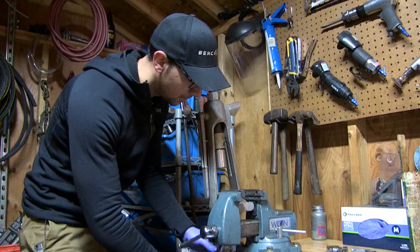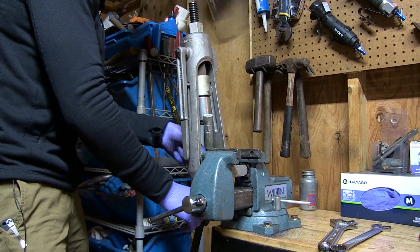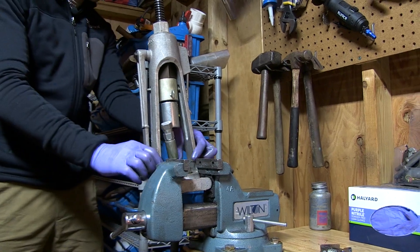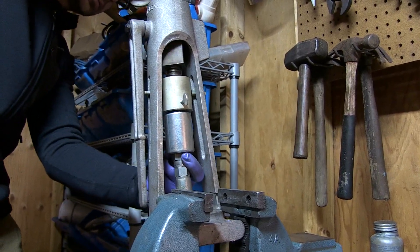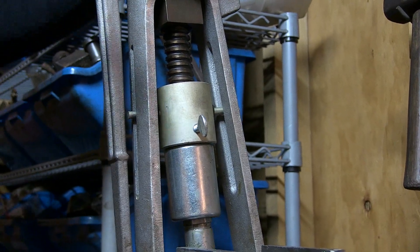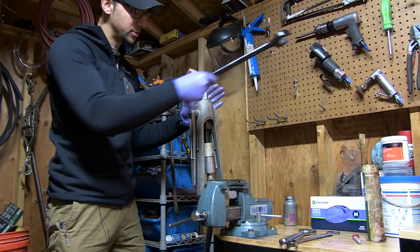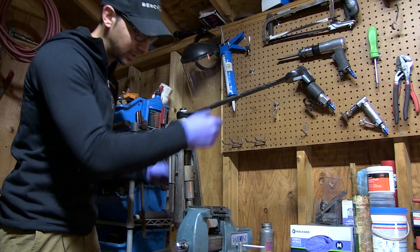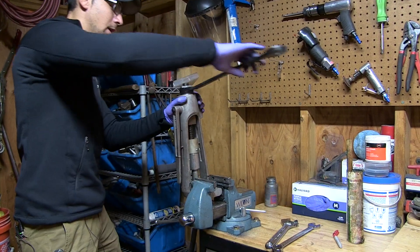Grab your fitting, slide it right in. Grab your other piece and connect them. Some swedge machines have a little wire that holds it down — if it does, just pry it up and now you're ready to go. Lower it down right into the top of the fitting by hand. Once it stops, grab your wrench and start pressing it down. You're going to want to hold the top of the swedge machine because we're putting a lot of force — if you don't hold it, it'll come right out of the vise. Put a steady hand on top, grab your wrench, and screw it down all the way until the pusher bottoms out to the die. Nice firm grip and just start pressing it down.